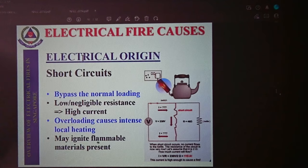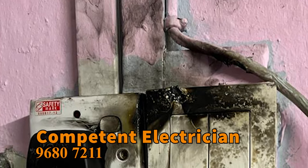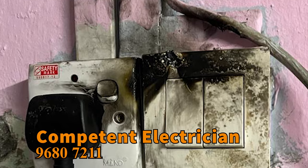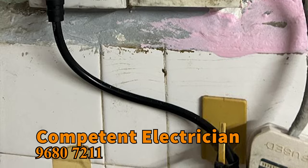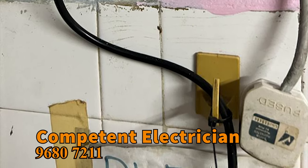This is the same example — this is the burnt wire. The current flowed through the shorter wire and went back to the source, creating a high current when there's low resistance. Look at the edge of the plug. How many years old is this?